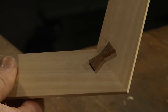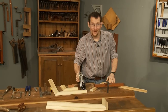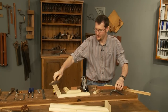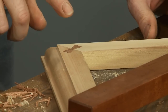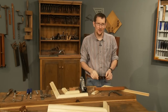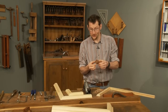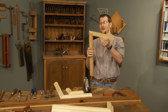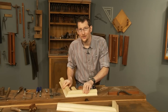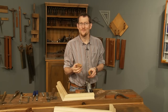When the glue is dry, saw off the keys almost flush with the workpiece and then finish them off with a plane. That's the last of my four butterfly keys, all planed flush now. This is a really useful way of producing a nice strong joint, because the butterfly key has the advantage of pulling the joint together without needing any kind of specialist clamps while it's gluing up. The taper I cut on here is all it takes to produce a surprising amount of clamping pressure across the join. To assemble the finished moulding, you simply glue together the cove and the ovolo — and that will give you a lovely cornice. In the next video, I've got another method for reinforcing the corner joint, which is really fast.